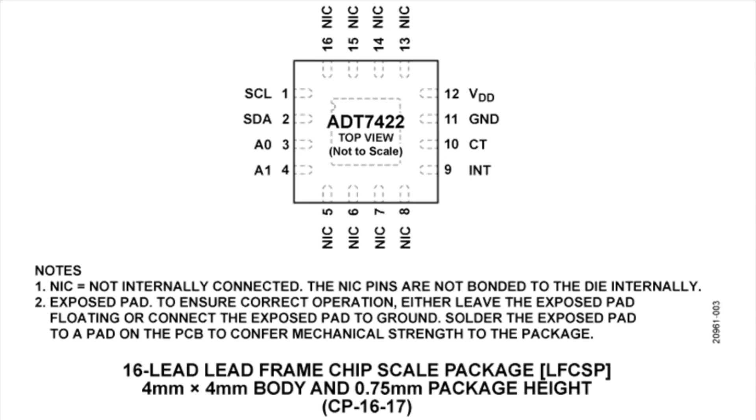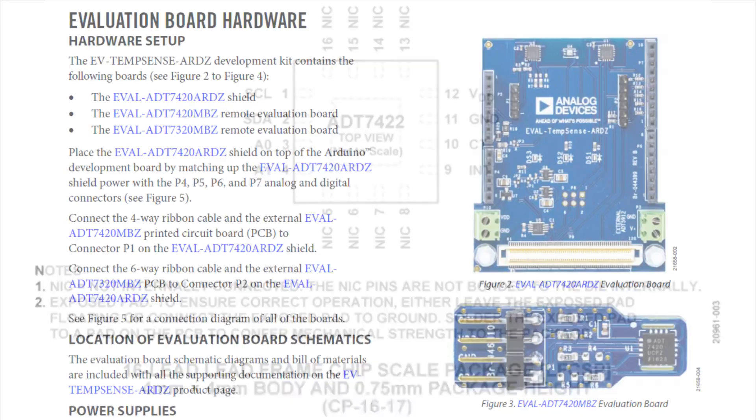This is the chip. Not a lot of pins going on there. I like that it comes in a standard QFN style, 4 millimeters by 4 millimeters — not too big, not too small, very easy to use. And if you've used the ADT-7410, all these pins will be familiar. In fact, we basically just loaded up our ADT-7410 Arduino code to test out the chip, and it just worked, because it's basically the same underneath — just a more accurate, more precise sensor.